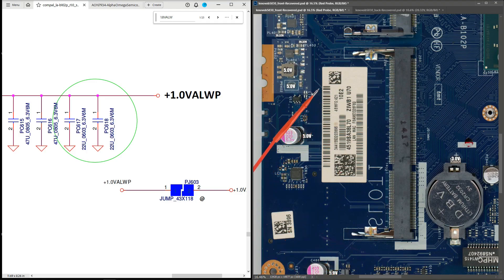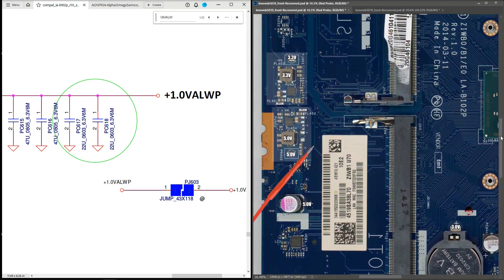Working back up the board, the 3.3V and 5V always-on rails are confirmed working from last week's video. Given I wasn't seeing anything wrong, I decided to compile a full table from the schematic listing every single voltage rail, what it should be, and what I actually measured - including which component I measured it at, in case I need to go back.